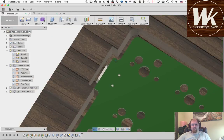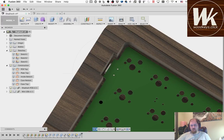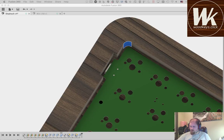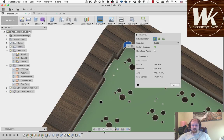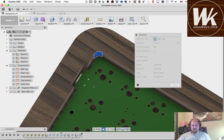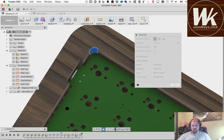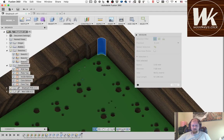So I'm going to cut this out. I'm going to attempt to cut this with a 1/4 inch bit. Sorry, just trying to read some chat messages. Okay, on my CNC, changing tools is fairly involved, as you'll see in a couple of weeks. So I try to avoid tool changes, and try to get this minimized down to as few tool changes as possible. I would like to see one tool do most of the work, which is a 1/4 inch, and then one that I can't really get away from, which is the 1/16 inch to carve out those little mounting holes.